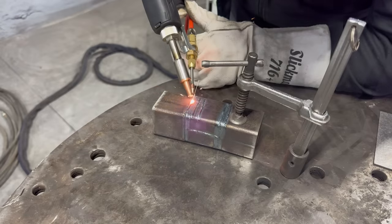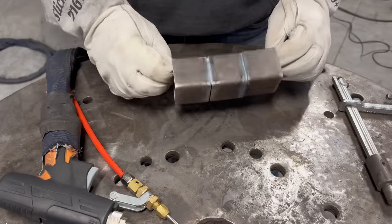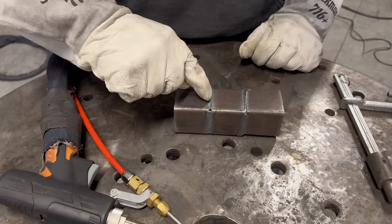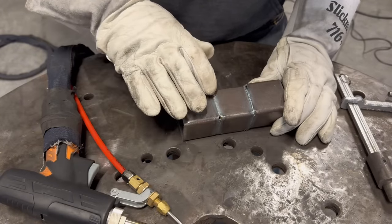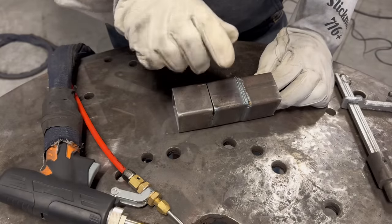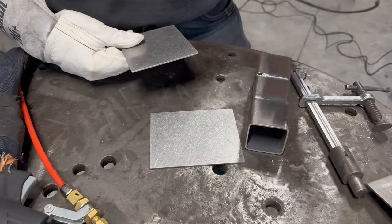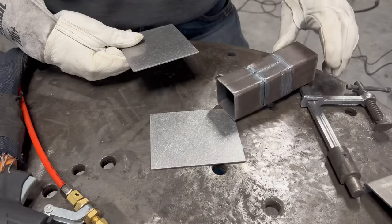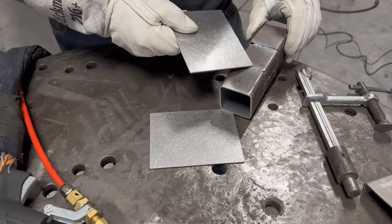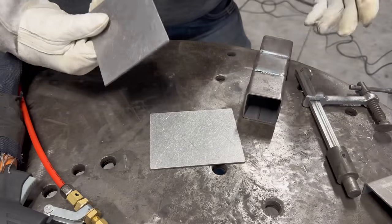With a little practice I can figure out how to get it to fill a gap, but I really just want to show you the struggles I'm going through. If you have zero gap and butt it up perfectly, it does make a nice little seam — really nice. But if you have any gap at all, you'll lose your ground. The tubing was a fail everywhere because the gaps had to be flawless. One part where it was butted up perfectly welded just fine with a real nice seam, but any type of gap and it just doesn't want to weld — it has no feel.